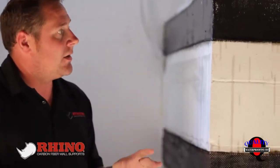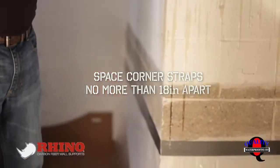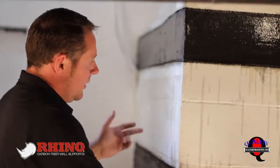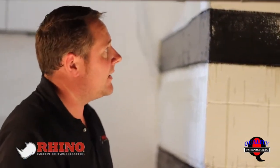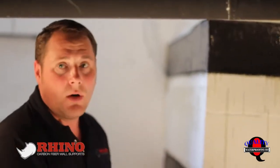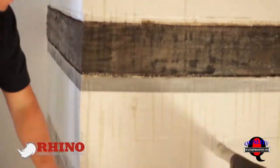So when you're laying out your repair, you want to make sure that you space these no more than 18 inches apart so that you make sure you strap the corner well. Just like if it's a bowed wall — if there was a crack here or here, you would want to take and clean that crack out and put hydraulic cement in it or mortar. Make sure it has something solid in it. Make sure there's no caulking in the wall. And you would grind that down just like we did these sections here.